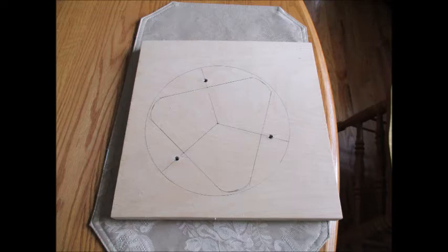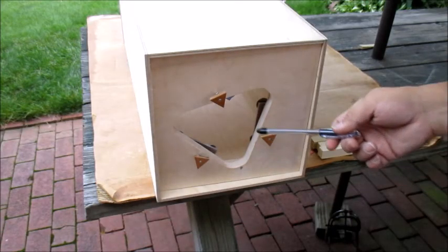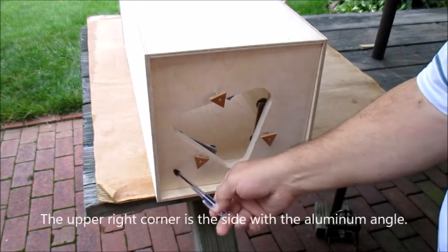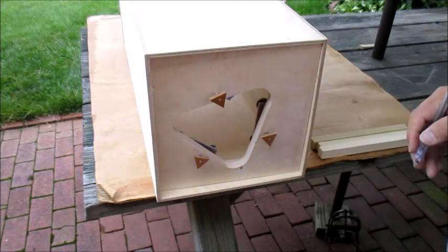I made adjustment knobs out of triangular pieces of hard maple plywood, threaded and fastened down tight with a nut. For side support I used right angle brackets from Home Depot and super glued a half inch section of sheet rubber in the middle of the bracket. I had to change to a larger two-inch bracket. Here's the mirror cell in the back of the mirror box — notice it's tilted two and a half degrees. This side is .67 inches lower than the other side, and these two corners are half of that, .33 inches, to give the two and a half degree tilt.